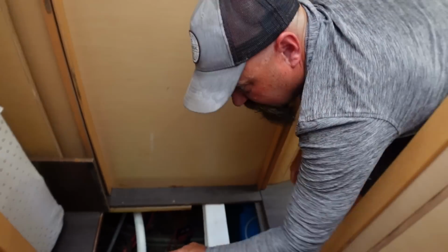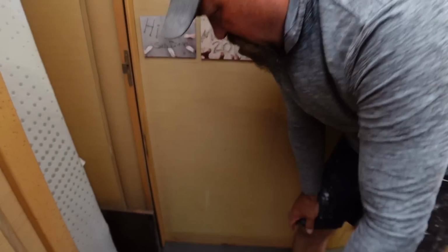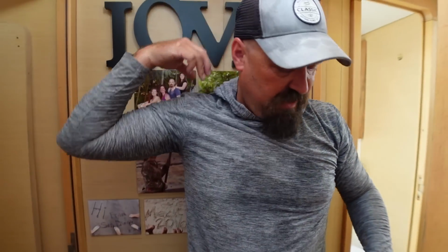Ty? Yeah? Are you doing a shitty job? Yes. What shitty job are you doing? I'm replacing the waste hoses. Last time I replaced them, of course, Lagoon uses 2-inch hose in Europe. You can't buy 2-inch hose here. So I had to buy these special adapters and get them shipped from overseas. The cool part is, now there's 1.5-inch line, which is available everywhere.